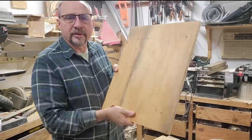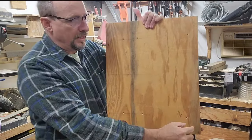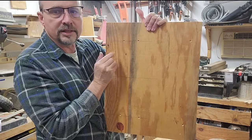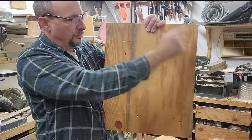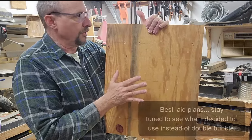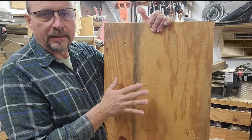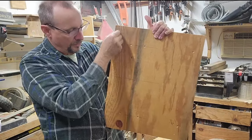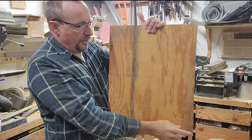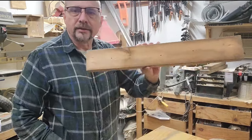So this is a part of the top, or the top piece, I guess. The shim that people like Ian Stepler and Bob Benny put on theirs to make space for pollen patties, instead of making that 3/8 inch thick or 1/2 inch thick, I'm going to make that a 1.5 inch shim all the way around. The reason for that is I'm going to put 1 inch of insulation and then about 1/4 inch, whatever the addition of a piece of double bubble would be, and then there's some space left over for pollen patties or whatnot. But that's the next piece. I'm going to put pieces along these edges that are 20¼ by 1½ inch deep by 3/4 inches wide, and I'm going to make those out of solid wood. I'm going to cut those out of these scrap 2x4s.